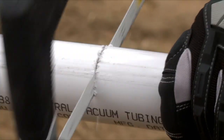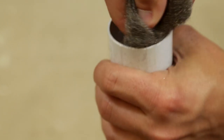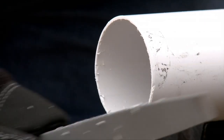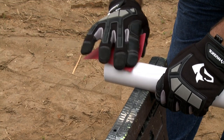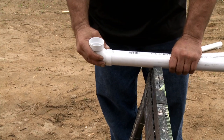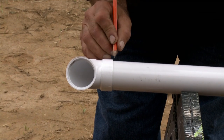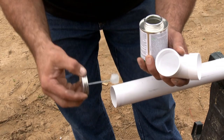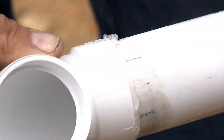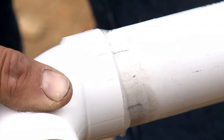For flexible piping, use wire cutters or tin snips instead of a saw. After the piping is cut to length, use steel wool to remove any burrs from the inside of cut piping, and a file to bevel the outside edges so it will easily slide into the fitting. To ensure a good seal, use steel wool or light grain sandpaper to buff the surface of the pipe that will be glued. To make a joint, dry fit the pipe into the fitting, aligning the two parts as they will be installed. Mark the pipe and fitting so you can quickly realign the joint. To glue, apply an inch-wide band of cement only to the outside of the pipe. Insert the pipe into the fitting with the alignment marks a quarter turn apart, then quickly push and turn the fitting to align the marks and spread the cement. Allow 1 minute for the joint to dry.